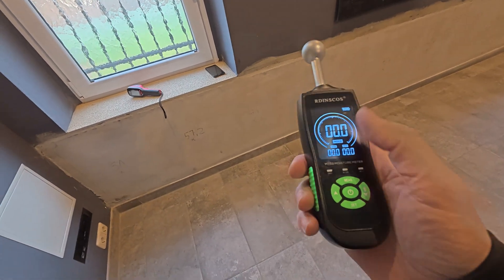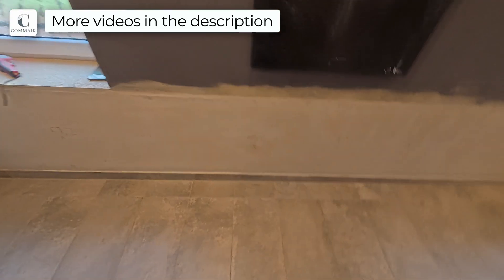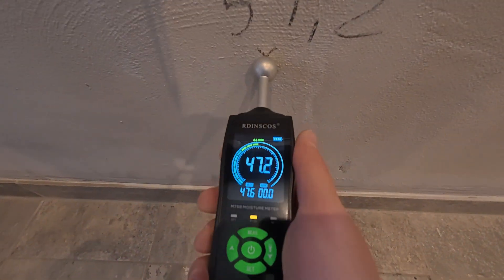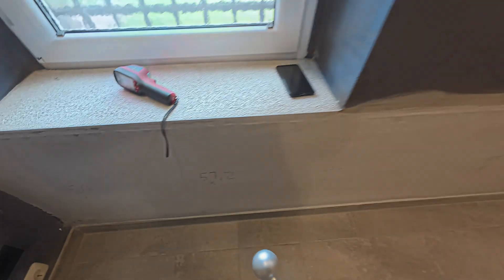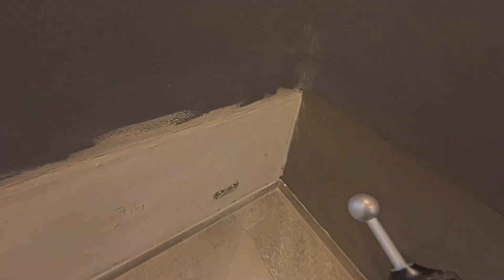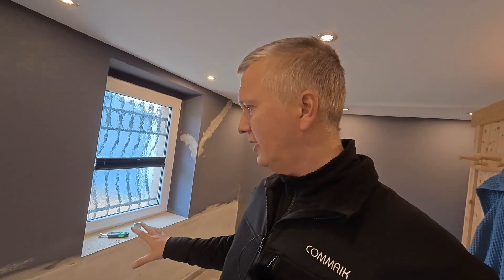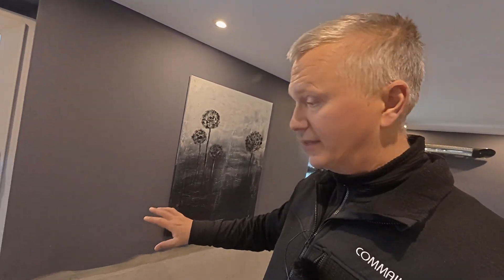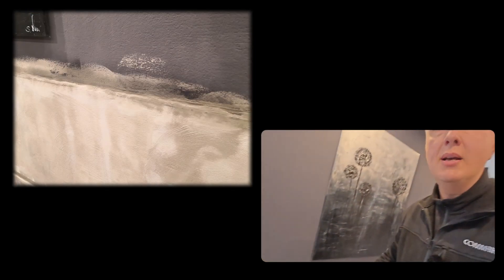There's one thing I definitely want to show you. I've got my humidity meter calibrated. Right here, as soon as the plaster filler had dried, I took the first measurement. And now measuring the wall again after the heater has been running for two days, you can really see the difference clearly: from 57 down to 47, then from 51 down to 49. I also had peak values here: 70 down to 44. And even back here in this specific corner, from 52 down to 43. That's quite a substantial amount of moisture that has been effectively reduced within the wall structure — which was also one of the goals, to simply make the wall drier. Curiously, when I turned on the heater for the first time, water deposits formed above the film — you could really see how the water was pushed from the bottom to the top and then evaporated into the room.